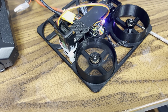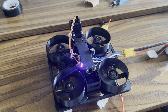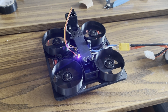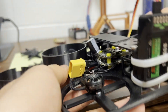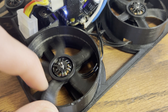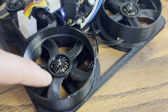I basically ran the fans for about two minutes each, which wore down the PLA for the fans and ducts until there was no more friction. You can hear the progression to the point where the fans are just spinning and not coming in contact with the ducts anymore. You can see that the fans were wearing down the ducts a little, so I had to make sure to mark the fans and ducts to match them up. All of this resulted in a fan-duct gap I was super happy with — now something on the order of a tenth of a millimeter.